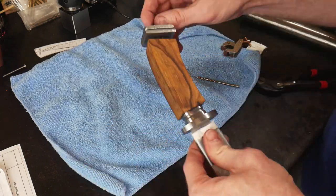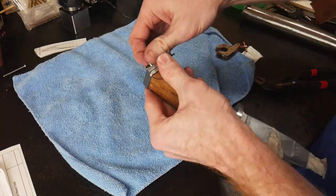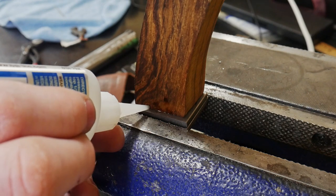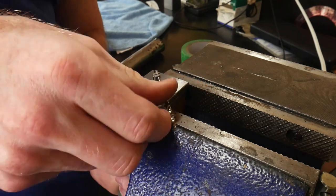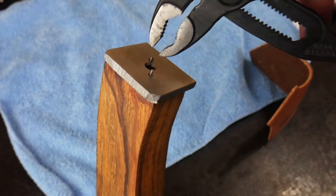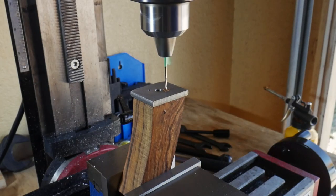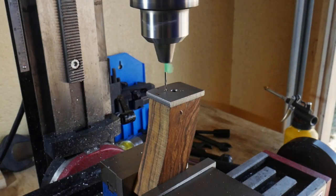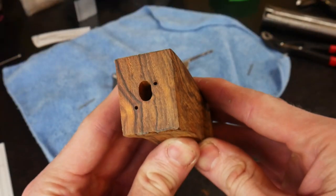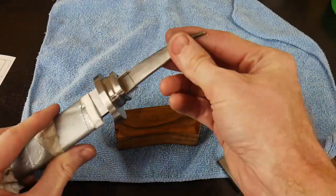I drilled some one-sixteenth inch holes into my old pommel, clamped it onto my new pommel, and drilled through it so I can line up the holes on the pommel with the holes in the handle material. To do that I stacked them together, clamped the knife together, and super glued the drill guide onto the pommel section of the wood handle. After the glue set I drilled through the holes in the drill guide into the handle material so that when the knife is assembled they will line up with the two holes in the pommel, allowing the dowel pins to hold the pommel securely onto the back of the handle the same way every time.